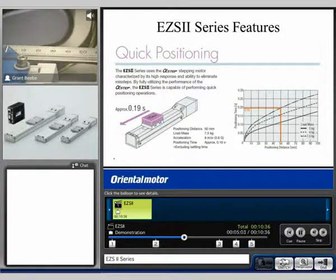I'm going to manually move this table forward using the EZE2 software. Right now I have the minimum move distance set for half a millimeter, so every time I click on the mouse, it's going to index forward at one half millimeter.